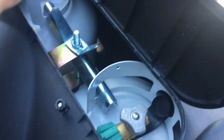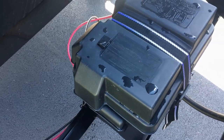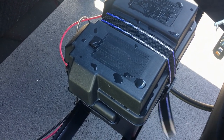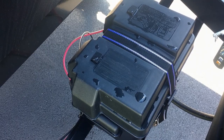One of the last steps: make sure no power is on the motorhome at all. Pull any cables off the outside and turn your master switch off — in this case the key comes out, so we know there's no power going into the motorhome. Make sure both propane tanks are off; if one's empty, get it filled for your first camping trip in spring. Also get that battery out — don't leave it sitting out in the elements. Take off the connectors, mark them properly, and store the battery on a thick piece of wood in a warm basement — not on bare concrete. Use a trickle charger during winter and it'll be in good shape by spring. You just winterized your own RV and I guarantee you saved a hundred dollars — it cost me about $21 for RV antifreeze.